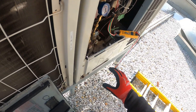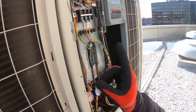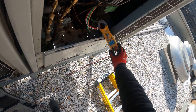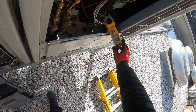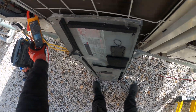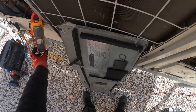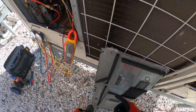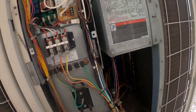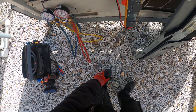I got my amp meter on both compressors right now. Both condenser fan motors started, so it's a matter of time before these compressors start. We got 11 amps on this one and 5 amps on this one. It was trying to ramp up and then the condensing fans shut down — both shut down, everything shut down, no more amps.